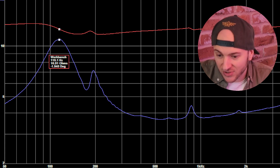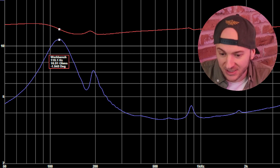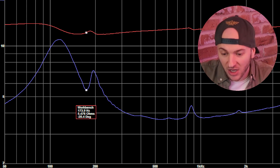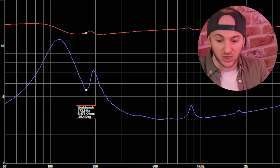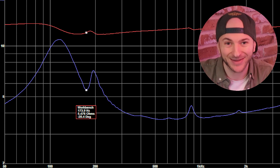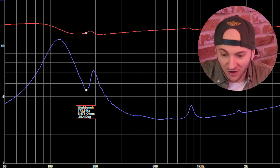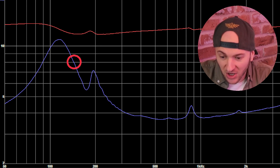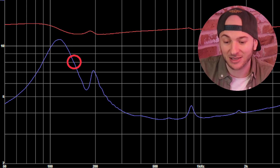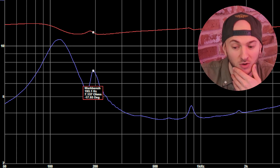The first impedance spike is at 113 Hz — that's well below all the frequencies we're testing, so fully unloaded, up at 10.8 ohms. The impedance valley, the dip, is at 175 Hz, down at 5.4 ohms, which is still quite a bit higher than this woofer's nominal impedance, so not a great deal of cone loading from the enclosure. That is smack bang in the middle of the two lowest frequencies we test, 150 and 198. At 150 Hz we're up at 7.2 ohms, and at 198 we're very close to the second impedance spike at 6.9 ohms. So I think we're going to get a fair bit of cone displacement going on at those two lower frequencies.